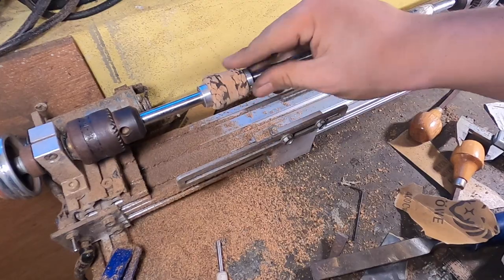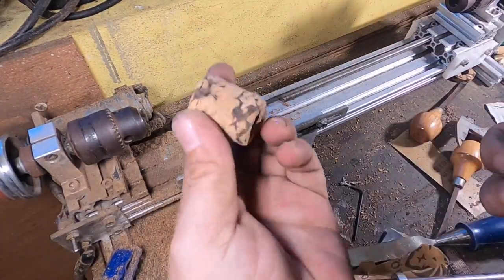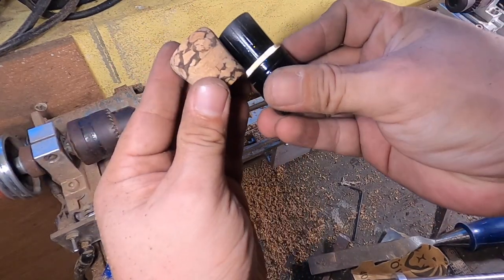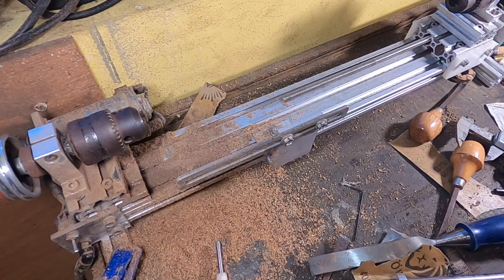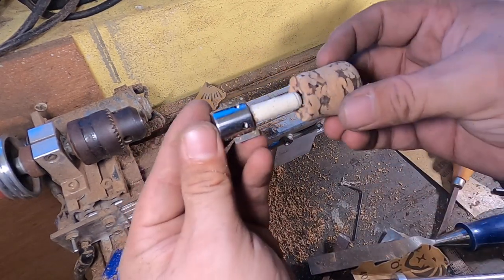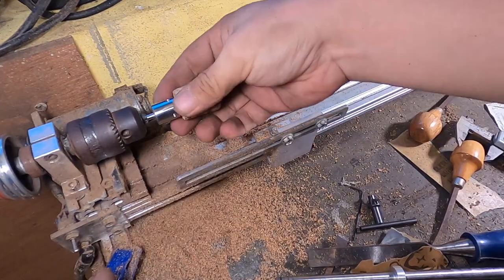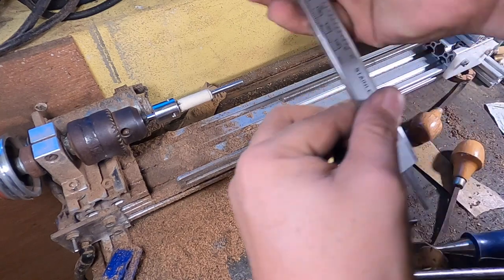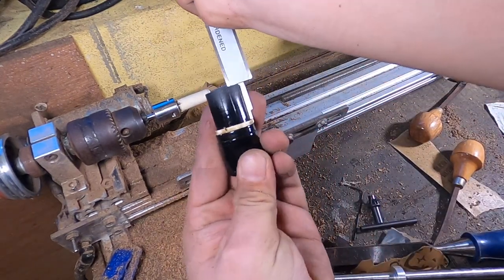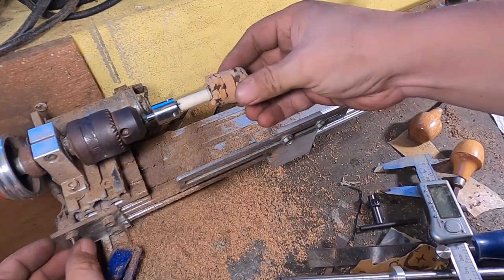We're kind of done — it looks pretty good. I'm taking it off the mandrel to try fitting it and check whether it will fit nicely. It's a bit tapered, so I'm deciding on the position — I think this position looks a lot nicer, so I'll go with that. We pre-shimmed the Crafty Cutter with masking tape; it's going to act as a guide and cut the inlet hole. You can use a drill too, but I prefer this as it's locked in position and more stable. I'm measuring the depth needed for the inlet hole, locking it, then cutting that in now.